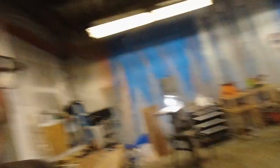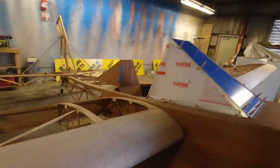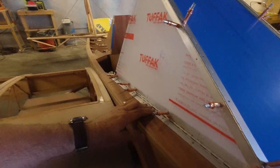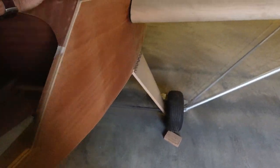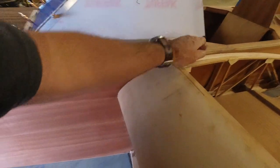I'm looking really good here, super happy, and everything worked out. Everything fits really good and I believe this is going to make a very rigid assembly when this is actually screwed to the deck. I counted 21 nut plates. I ordered some flush rivets, so I'm going to flush rivet those to the deck. It'll just be super easy to spin those out, take out the two bolts, and remove this whole assembly.